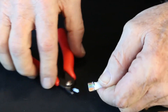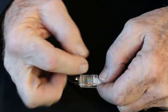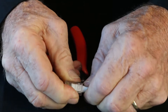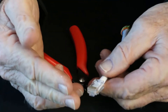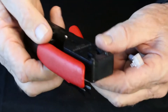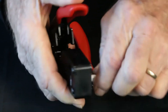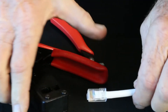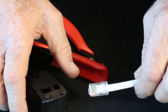Take your connector and just go in. You'll feel the bar snap into place when it gets up inside under the contacts — and right there it's snapped. You'll feel it and you'll hear it. So let's take our Tele-Titan tool here, put this in, make sure you hold it tight while you're crimping it, bring it down, and there you go. CAT-6, high performance, quick and easy. It's a great connector. Thanks.